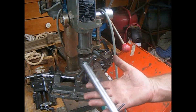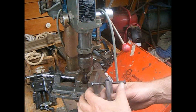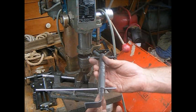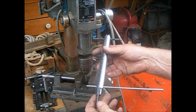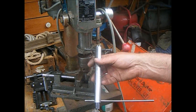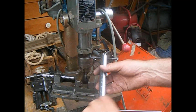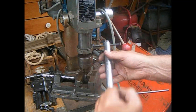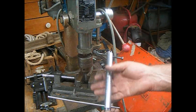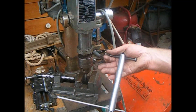Here we are — a little bit of pre-assembly. You begin to get the idea what's happening here. These will be screwed in, the excess will be cut off the inside, and the outside will be ground off to form the jaws. This is where it's handy when you have a reamer — when you've got it all together, these will just move about slightly, and steel does not know the meaning of approximate. It's got to be right, to fractions of a millimeter. So we'll ream that through again until we get a nice workable fit. We've got to cut the thread on here, but we're almost done.